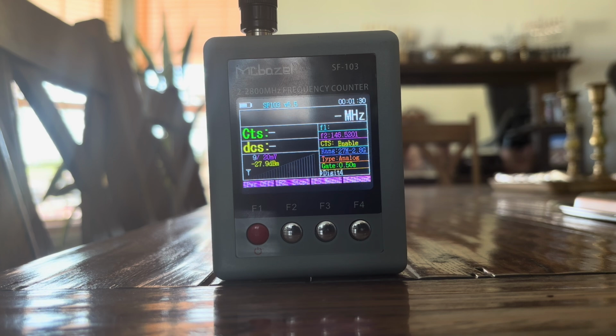Okay, the field strength meter test allows us to see how strong the signal is coming out of the antenna over a distance. The distance is prescribed, the sensitivities are set up a certain way on the meter, and the power on the radio is set to high. So let's do our first test on the 2-meter band. Next, we do our test on the 70-centimeter band. And last but not least, we're going to do our test on the GMRS channel 16.